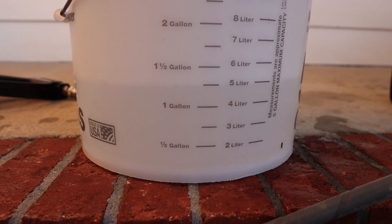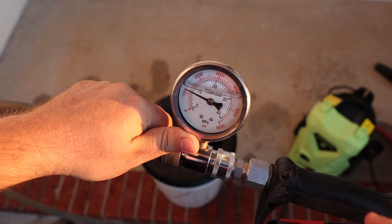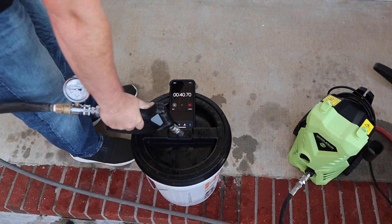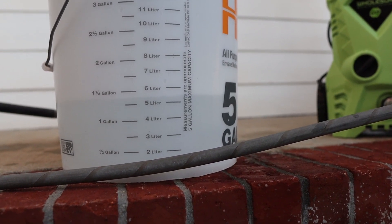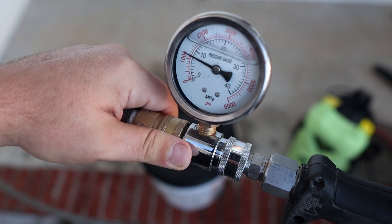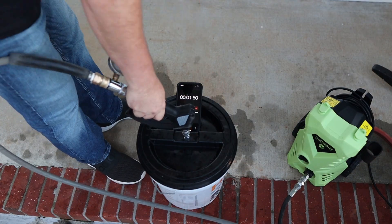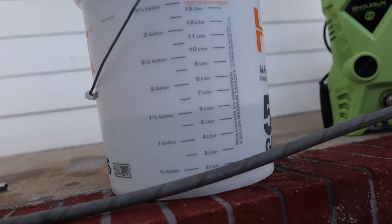With the 2.5 nozzle, amperage is about 9.10 — slightly less flow at about 1.35 to 1.4 gallons per minute. The 2.6 that came with it gets just a little bit more. Moving to the 3.0 nozzle, the last test, we get about 700 PSI — pretty low — but over 1.5 gallons per minute, just as expected. So that's the range: smaller orifice gives more PSI but less flow; larger orifice gives less PSI but more flow.